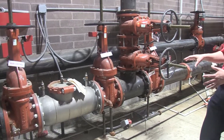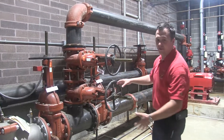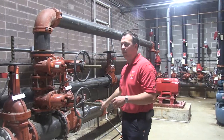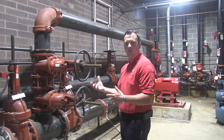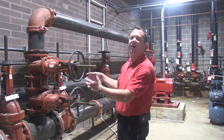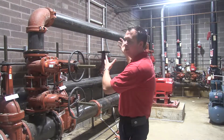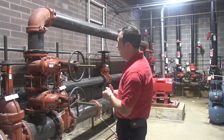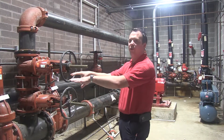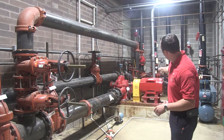For this system, because we have a fire pump, after the main control and backflow preventer you're going to see another set of valves. If you get confused, always follow the piping — this one goes up and around past our fire pump. This serves two purposes: the fire pump runs itself once a week, kind of like a generator, to keep everything lubricated. It's like recirculation on a fire engine — you pull your tank to pump, you pull your tank fill. This allows water to move around because the system is still under pressure on our risers. And if the fire pump did fail, this allows us to pull water out and past it so we don't have to pump through the resistance of the fire pump.